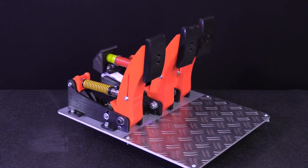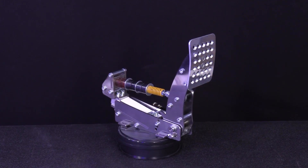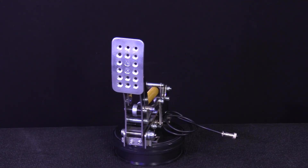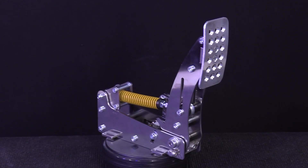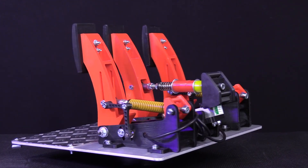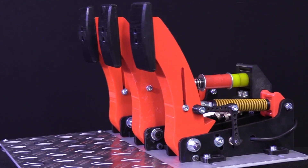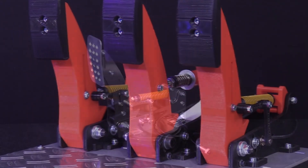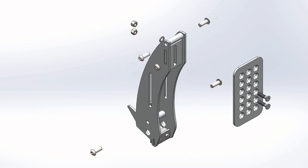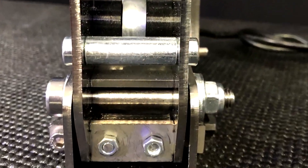When we look at the 3D printed set, we can see they're all bright and flashy — red and black — and obviously you could print these in any color you want. And here are the pedals in the stainless steel, all polished up and beautiful. No matter which version you build of the DIY Sim Studio pedals, the overall concept, design, dimensions, adjustment, and construction are nearly identical, with the biggest difference being the pedal arms themselves. The 3D printed versions are solid, as in it is one piece from the lower hinge to the foot pad. Comparing that to the metal version, which is a sandwich or ladder structure with two outer plates spaced apart by metal pieces and bolted together to make a solid piece, which then connects to the base at the pivot point and extends up to the foot pad.